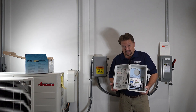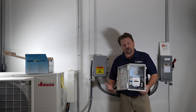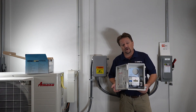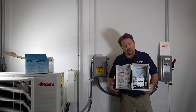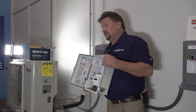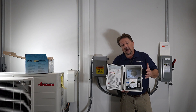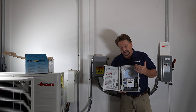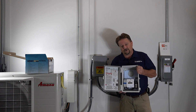It is highly recommended — more than highly recommended — that you put this on every inverter unit you install. When you do, you have the peace of mind that you won't have to go back out to that customer. I would include this as part of the price of every inverter unit I sell, no question. This is the RSH-50 VR MDC kit — I'll put the Johnstone supply number in the description below. I highly recommend it for every inverter install.